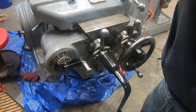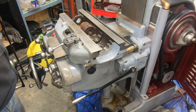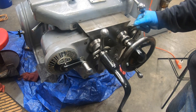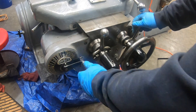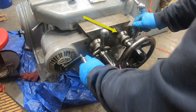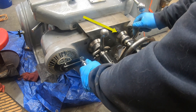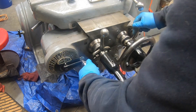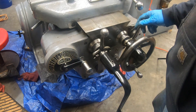I will go ahead and turn the spindle on and check the speeds and feeds. I have got it set for one half inch per minute, and you can see the graduated dial for the saddle is spinning with the power feed. We will crank it up to 20 inches per minute — it takes a little bit for those gears to mesh.